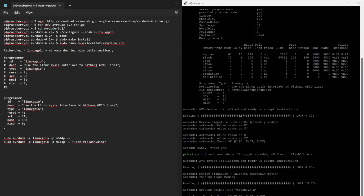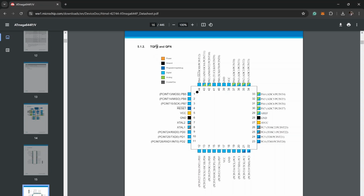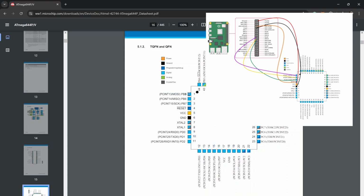And then to write it, all you have to do is replace the R with a W for write. I will try that in a next video once I've received a replacement chip. And just to show the data sheet quickly, I have this version here of the AtMega644P. The pins I connected to are these 6. We have the SPI interface, the reset pin, VCC, which is connected to 5 volts on the Raspberry Pi, and ground.